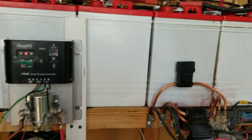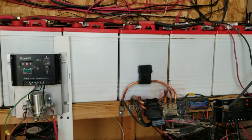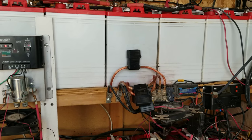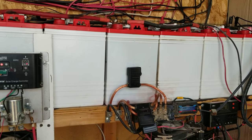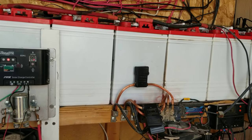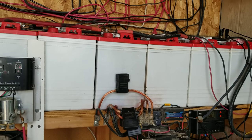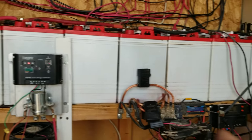These forklift batteries I recommend as the least expensive way to go — I bought them brand new at $100 a piece, and now they're $160 a piece. Your solar panels and your turbines are all just battery chargers — they charge the batteries. After the batteries are charged, if you still have sun and wind, the extra electricity helps power everything you've got, so the batteries aren't doing the work at that time — they get a break. When you plan everything, figure how many watts you need to run everything for the maximum time in a 24-hour period, then double that. That's what you want for a battery bank — because if you go 24 hours off the batteries, you're going to want to handle that. I went three times what I needed.